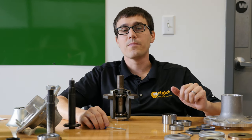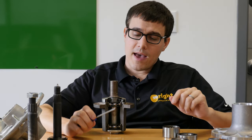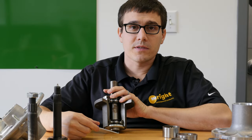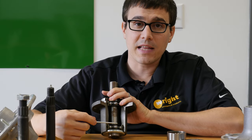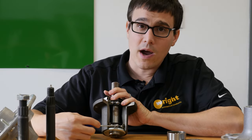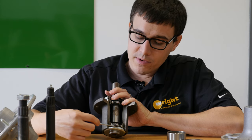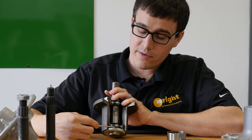What are some of the major failure modes? The first is that oftentimes, especially in the bottom of your spindle, you can get something wrapped around the bearing. It could be a plastic bag, a fertilizer flag, a piece of twine, or the fabric from a silt fence. It'll get wrapped around the seal, climb up into the bearing, and destroy everything really quickly.